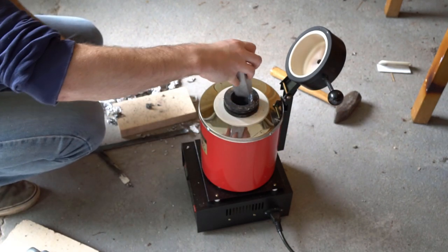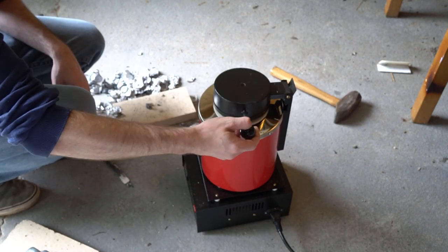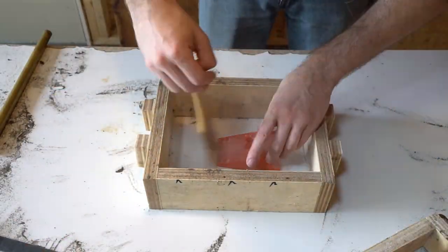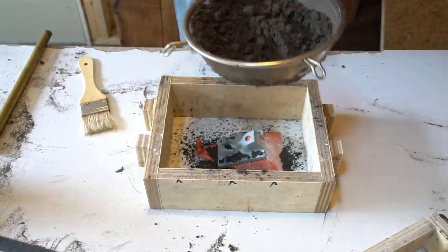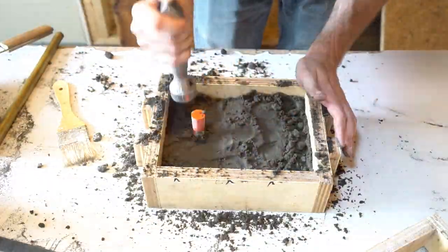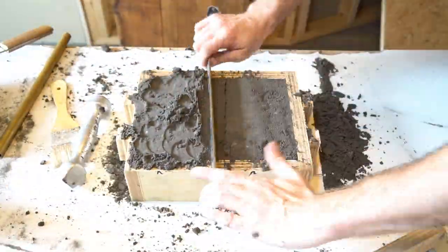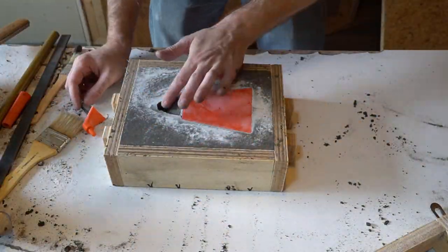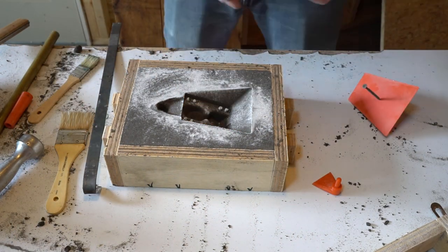I loaded my crucible and started heating the furnace. I'm aiming to cast at around 750 degrees Celsius, which is about a hundred degrees warmer than the melting point of aluminum. While the furnace was getting up to temp, I packed my first mold. I'm starting with a base plate - I got my buck and other sand forming tools in place, then added my green sand and packed it down, struck the mold, and removed my sprue. I flipped the mold, removed the jig from my parting line, coated it with talcum powder to keep the mold halves separate, then added sand for the second half.